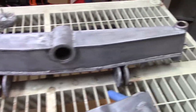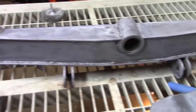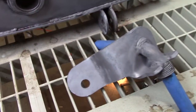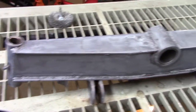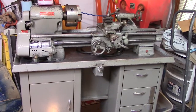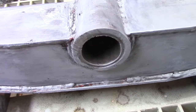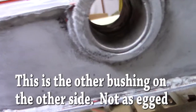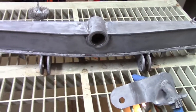That's how she looks after the phosphoric acid is on there for a little bit and dries — I wipe it off and that's the little haze it leaves on there. This is now rust-proof for the winter. Hopefully this bushing I'll be making on my new lathe, previously seen on Tool Gloat. There's the bushing and you can see it's worn out around there, so I'll use my press to press it out and see if I can make a new one.